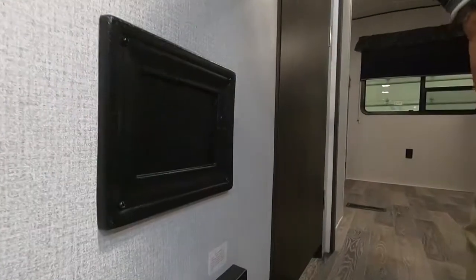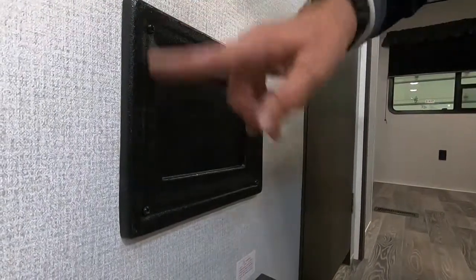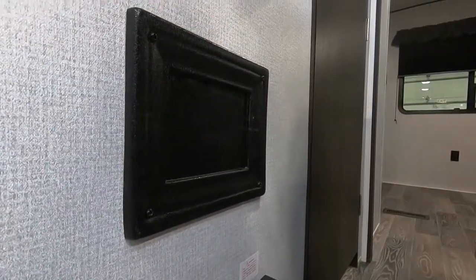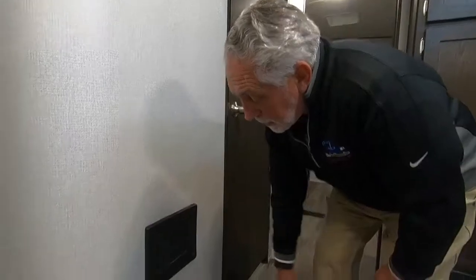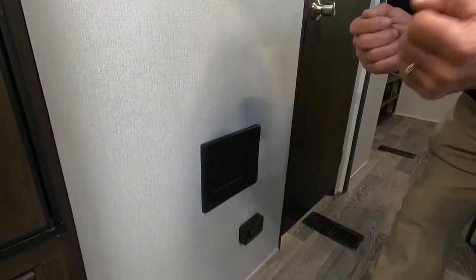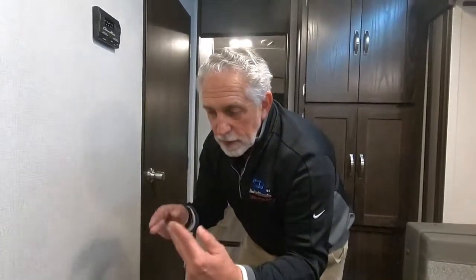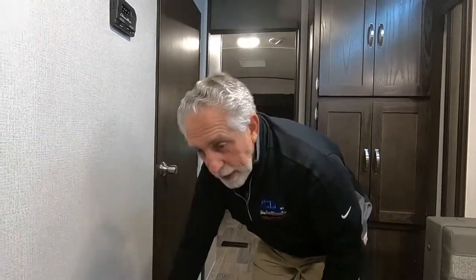This is a little access panel to your shower faucets. If you ever need to work on them, take these four screws out and you can get to all that right through there. Right below that is your carbon monoxide sensor. This is not running off a battery — it's actually hardwired into your circuitry, so it lasts five to seven years. If it starts going bad, it'll start chirping at you. Take the two screws out, pull it out, and if there aren't couplers in the wiring, just cut the wires, get your replacement, put couplers on the wires, put it back in the wall — two screws and you're good for another five to seven years.